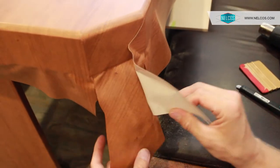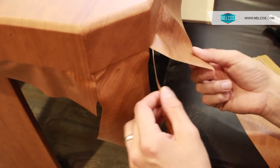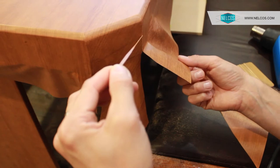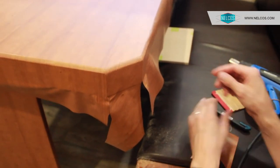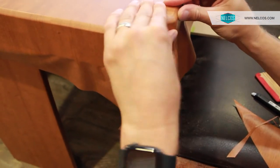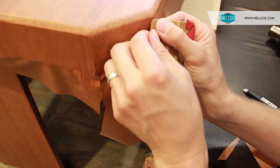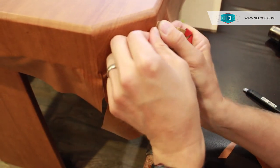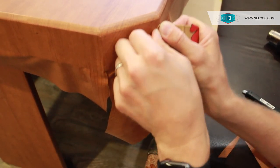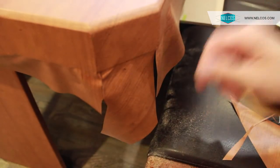Underneath I've got this small piece of material and I just slowly want to pull that out. With that out, I can start to join the edge — the seams of our double cut. You can see as I push that down it's now almost invisible, and then with a back-and-forth, side-to-side motion with my squeegee I'm essentially just going to pull it down and almost weld the two together. That's our double cut, and that seam is almost seamless.